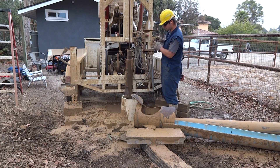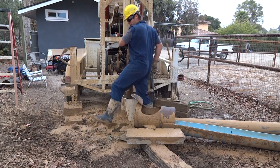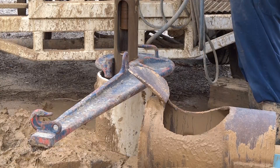Always look for damaging wear to your mainline cable. When a repair is needed, bring the drill stem partly out of the borehole and secure with a J-wrench so the swivel can be accessed.